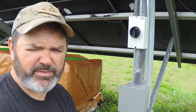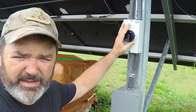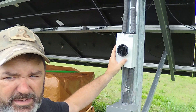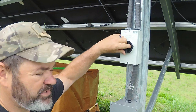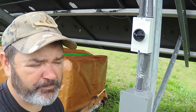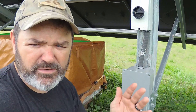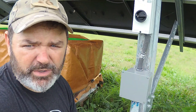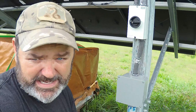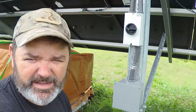One important thing to remember when dealing with solar: I'm out at my array right now. Here's the PV array DC isolator, also known as a cutoff switch, that I got from Scott. I'm going to go ahead and shut that off, because you can't really stop solar panels from producing power. That power comes from the panels down the line into the conduit in the ground and over to my solar shed. The wires going to my SolarK would be hot regardless, so we're shutting off at the source to make sure I don't zap myself.